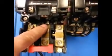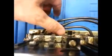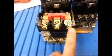When you purchase one from a supplier, it usually comes with the wires already interconnected between them and all you have to run is your line 1, 2 and 3. If you notice, on this unit line 1 goes to line 3, line 2 goes to line 2, and line 3 goes to line 1 — so the phase reversal switches are already made. All you have to do is come in with line 1, 2 and 3 on one side. In between they hook up line 1 to 1, 2 to 2, and 3 to 3. And of course you would hook up your motor's T1, 2 and 3 right there.